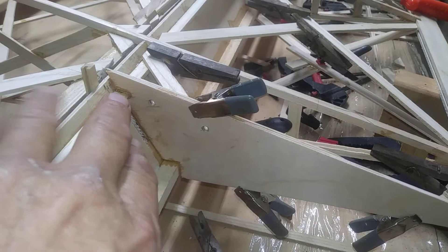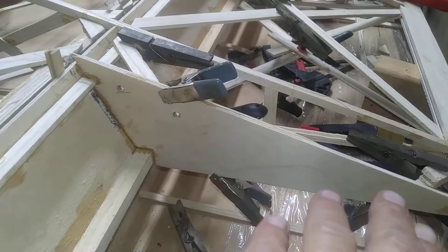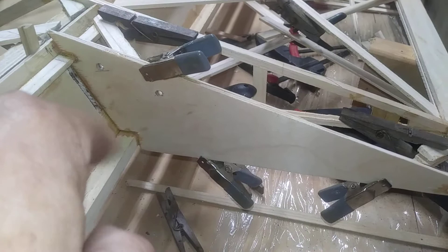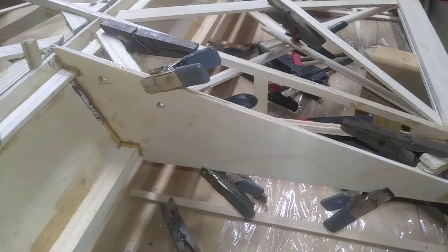Basically, the only thing you can do is get the basic angle cut all the way to the full size down below this spar to where the ribs would reach. And then back here, do your half-inch high where it meets up with this — that's going to stay the same. The only thing you change is this angle here. You just keep on chopping it back, cutting out these notches, a little bit at a time until it slides in there just perfectly.